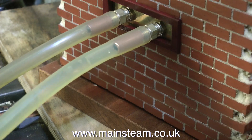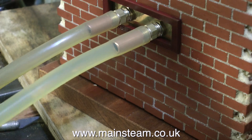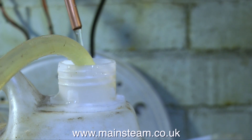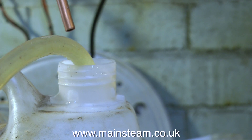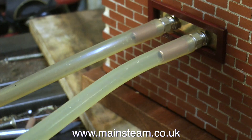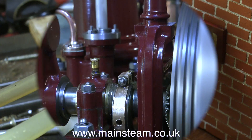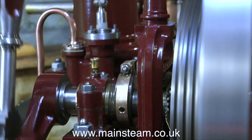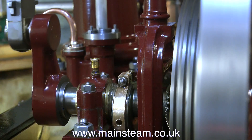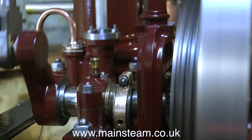While we're on the subject of pipes, these are a couple of water pipes I attach to the engine. The right-hand pipe is the water inlet, and it's sucked the water from the container without being primed. The other one is the water outlet, and as you can see, for every stroke of the engine you get a drop of water. After I'd finished, I pulled the pipe out for the inlet to drain the pump — it's quite important that I drain this pump. If you look at the pump ram, you'll see it's covered in an emulsion of oil and water, which will need removing if the engine is going to be stored for any time, just in order to prevent any rusting.